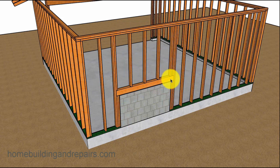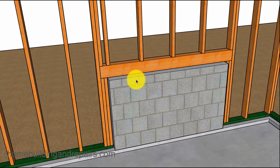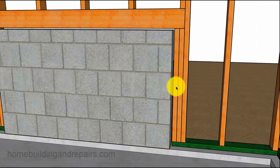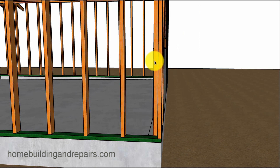Another method would be to build some type of framed system over it with a header and trimmers, something like you would install over a door or a window. You could also leave a gap — a quarter inch or a half inch — to reduce the amount of moisture that might transfer from concrete or blocks to the wood framing and cause rotting. But again, this all depends on how sturdy this wall is. If it's a strong wall that doesn't move, you'll want to attach the framing to the block wall. If it's a weak or loose wall, you might want to remove it or use the framing to make it stronger.